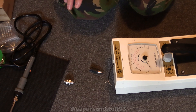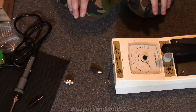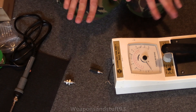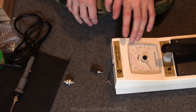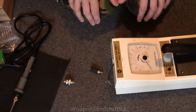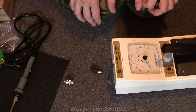What it should allow me to do is actually use it with things like this. I want to test the scintillator function on these, because you can use them with scintillators. The only scintillator I've got is the little mobile phone style one. If this all works I'll test it on a video. But if you did see these rate meters cheap, they are worth getting, because you can pretty much croc clip any GM tube on it, then just set the voltage or scintillator probe.